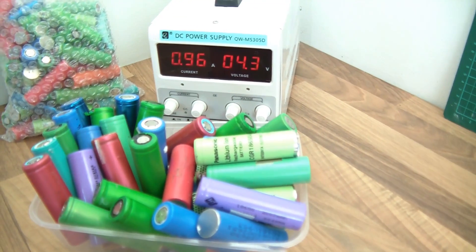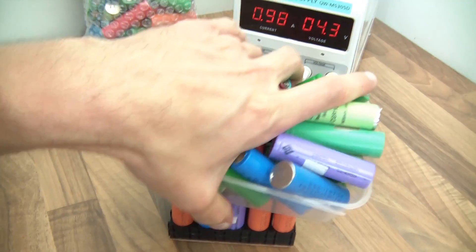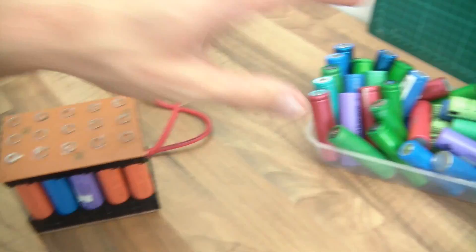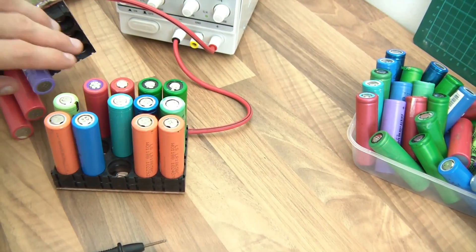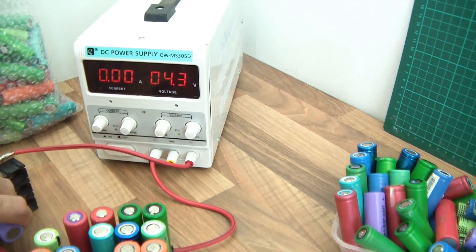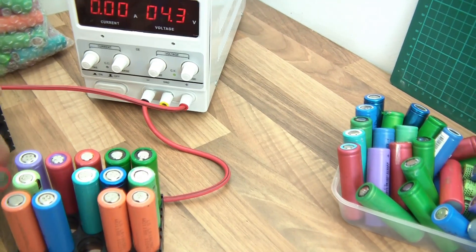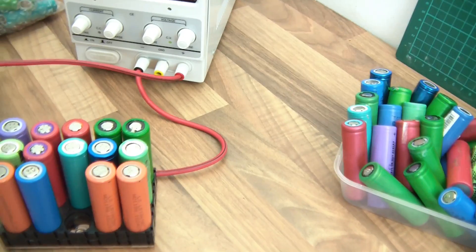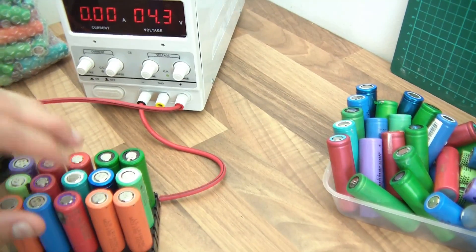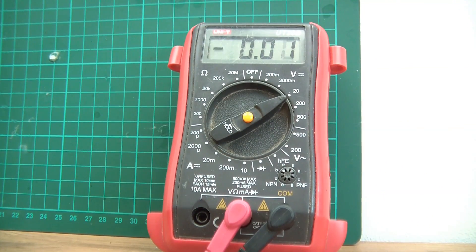Because I'm applying quite a high voltage I could easily overcharge these. So I'm going to take this off and just check the voltages. This one is 4.3 — I've got to be careful. I don't think there's going to be any significant damage by overcharging them by a little amount like that, but I don't really know. So the voltmeter's there — let's check these cells. Cell 1: 4.2, so it's fully charged.